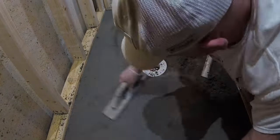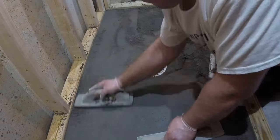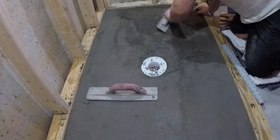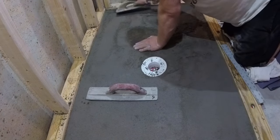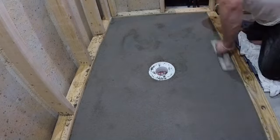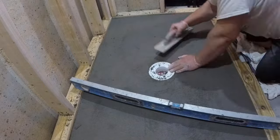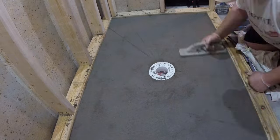This is where the different size rulers are very handy — they will show you all the high and low spots on the pre-slope and around the shower walls, especially when smoothing out the surface towards the drain. You can use the shorter one to remove any high spots, and if you have to build up some area, just sprinkle some mortar on the surface and smooth it out with the trowel. Keep doing that until you get a smooth and gradual slope towards the drain. To make the mortar even stronger, take the trowel and gently tap the entire surface of the pre-slope, which will increase the density of the mortar and make the pre-slope a lot stronger.